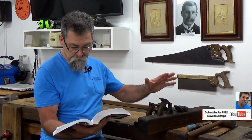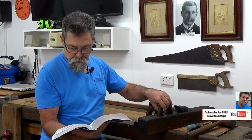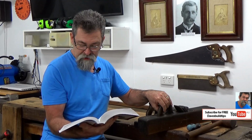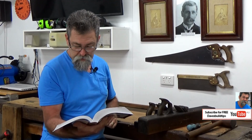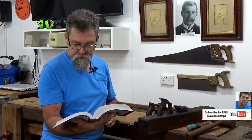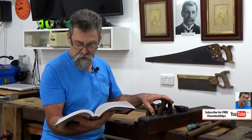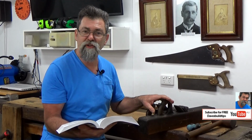The handle of the trying plane is usually closed, hollow clasp, and until about 1820 and occasionally later it was often placed off-centre towards the right or left of the user. This curious feature is of unknown purpose, according to this gentleman, but is almost universal on large planes of the 18th century, British, Dutch and Scandinavian alike. These planes are used for truing up the surfaces and edges of long boards, for shooting the edges of boards perfectly straight so that their juncture may be scarcely discernible when their surfaces are joined together.